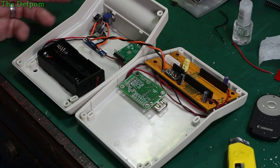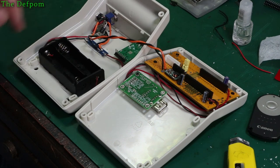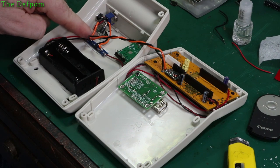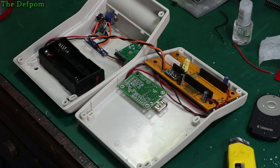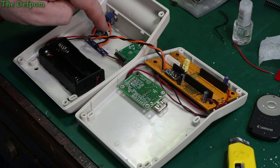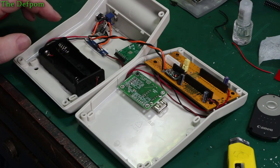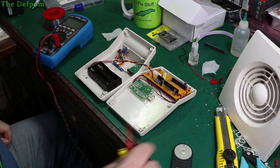What I really need to do now is hook up power to this, set this voltage regulator here up, make sure it works, and set that to a decent voltage, so about 9 volts or so, 9.5 volts. I think I found worked quite nicely, about 9.5 volts on there. Measured at that point in that Schottky, and then verify I've got 5 volts over here, and hopefully it'll be good. Okay, moment of truth.